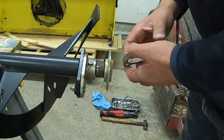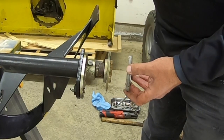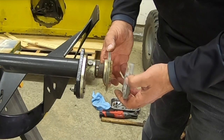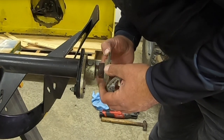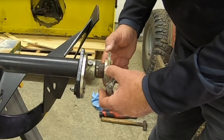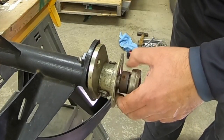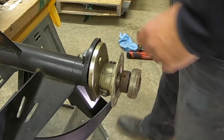This is a spacer that goes between the snowblower shell and the auger bed. And then these are plates that hold the bearing — they capture the bearing. They're almost like an external race to the bearing. So that cam space has to come off, and I believe it gets tapped to the right to loosen up.